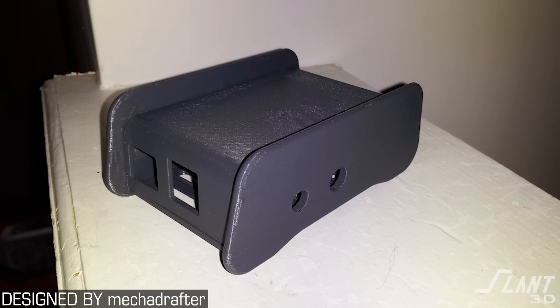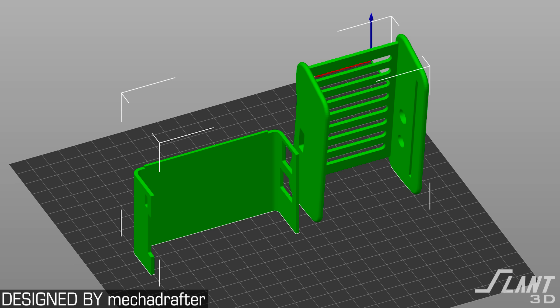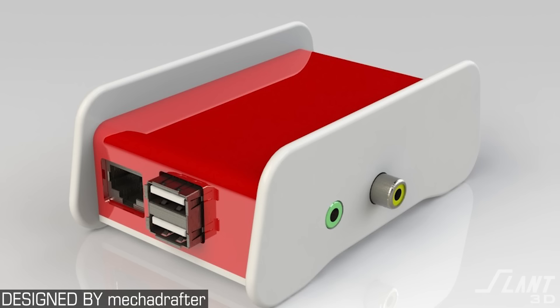Those organic shapes are tough to print because you can't really print them on their side. You'd want to design them so you can print them vertically, which would create the most strength — so the bottom plate would be against the bed, which would be ideal. Or if you took those two legs and leaned them up on end and printed them like that so they're sitting on a thin wall vertically, you'd get good strength, good aesthetics, and good producibility because it'd be really easy to eject from the machines. Not a fan of the fact that it's two parts, but that's not a big deal. It could use more fillets and rounding of the corners. Overall that's a good design and I like it quite a bit.